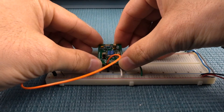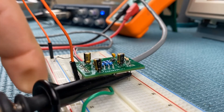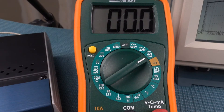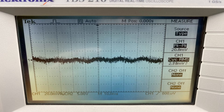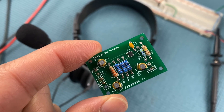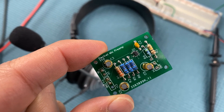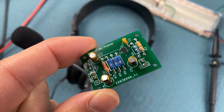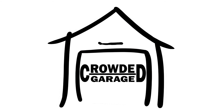The populated PCB is connected to the mic, audio I.O., and oscilloscope. Current draw for the circuit and mic is acceptable at 1.6 milliamps. A standard 9-volt battery has a capacity of between 400 and 500 milliamp hours, so this circuit should be able to run for about 250 hours. The operation and noise floor seem to be the same. It works pretty well and with a little post compression and gating, should provide decent audio quality. The sound of the mic isn't as good as an AKG535, but it will provide a good reproduction of the audio I'm trying to capture.